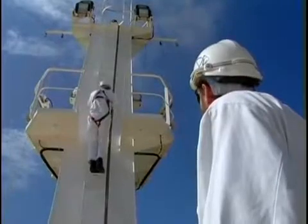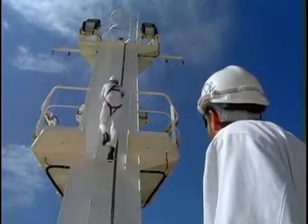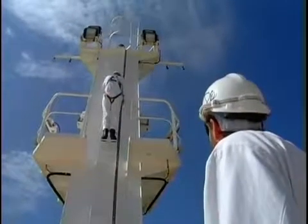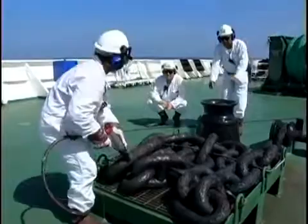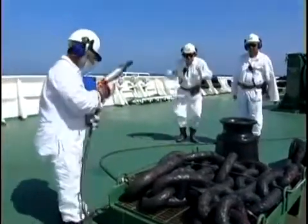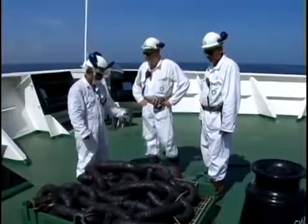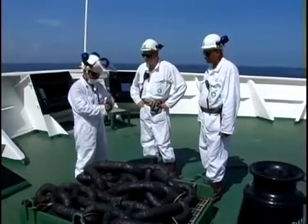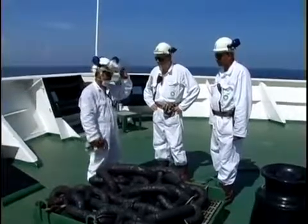As with any task that requires a permit, supervisory personnel must monitor the work from beginning to end. Permitted tasks are subject to regular safety audits. Don't be surprised if you're asked to stop and discuss the task with the supervisor. As the individual closest to the work, you have critical insights into whether the JHA and the work permit have addressed all of the potential hazards and risks.